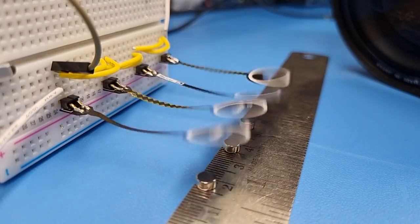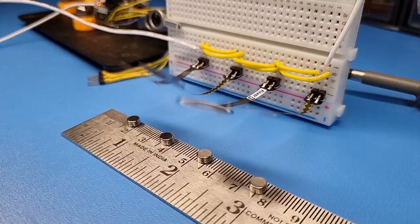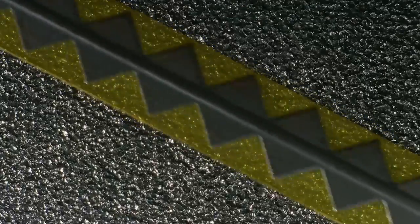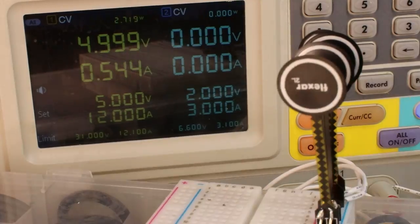The next obvious step was to combine the 2.6 mm arm with the hollow coil, which would have created a more efficient flap, but it didn't work because there wasn't any visible change between the normal coil and the hollow coil. What did prove useful was this patterned arm — the yellow regions are thinner because they don't include the solder mask, so it made it much more bendy.